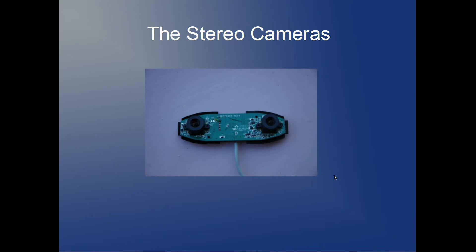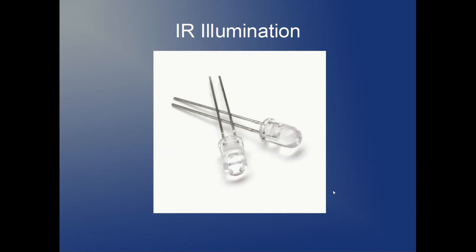You would also need a set of stereo cameras. An external USB 2.0 camera setup is unfortunately slow, creating visible latency that takes you out of the experience and ruins depth perception. The cameras also need to be eye-width apart to reproduce proper depth perception, and this spacing will probably need to be adjustable per user. Current prototypes simply don't work that way and are too slow.